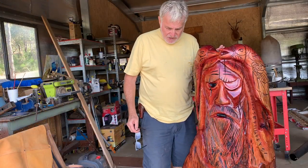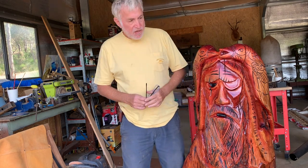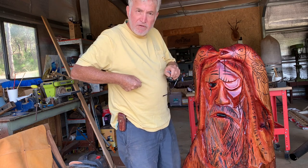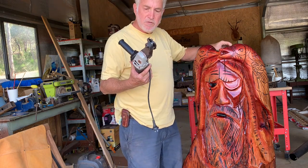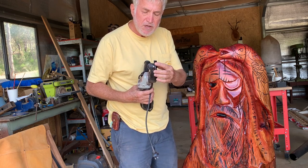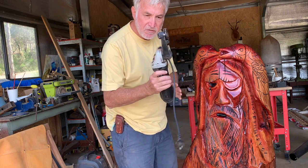Now, I know a lot of people are going to be asking me what tools I used for what when I did this. They usually do after these videos. So what I'll do is just quickly go through them so that it's nice and clear. As you know, I did the bulk carving using the electric chainsaw to just cut away blocks, etc. And I did go to use the chainsaw to do a bit of detail, but very quickly found it's very bulky and you're very far away from it. So I then turned to the mini grinder, which is this one here. This is the new mini grinder, which has got a double V belt, so it's much stronger. It doesn't slip, and it's got a carbide teeth blade called the Mini Pro, I think. And so it's got nice rounded carbide teeth and does a very smooth cut, and you can turn and go around corners. So I did most of the detail work using the mini grinder.